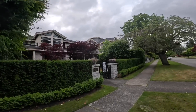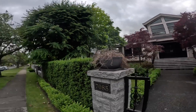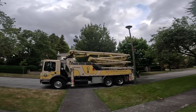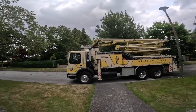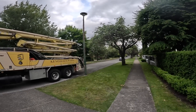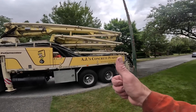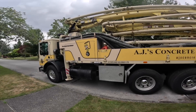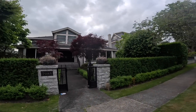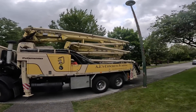One thing I will say: using the boom for this job today was completely not worth it. I would way rather run an extra two hoses, not have to deal with pulling back a sponge and the bigger hopper full of concrete and everything else that comes with it. I probably would have been better just to run the line right off the back end - way better to just use the line pump. Less fuel, less wear and tear, and I can take it home and park it overnight if I finish late. Share, subscribe - times three.